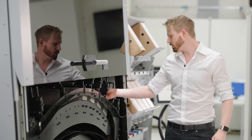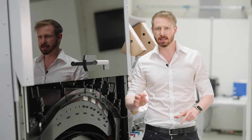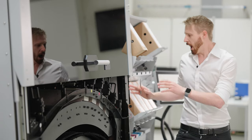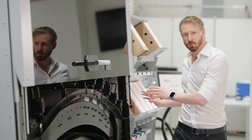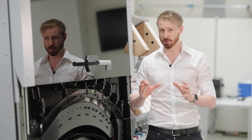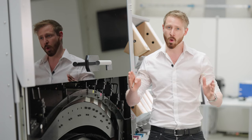To clean the pinning modules we have an easy slider to remove the glasses that protect them. The cleaning system is now our fourth generation and is equipped with ultrasonic cleaning to achieve the best cleaning quality and results ever. After printing we go to the curing system. Before the curing system we have our web vision system — our own developed web vision system. It provides the operator with fully automated missing nozzle detection and compensation on demand, and also supports the substrate qualification process as well as density uniformity monitoring over the whole web width.